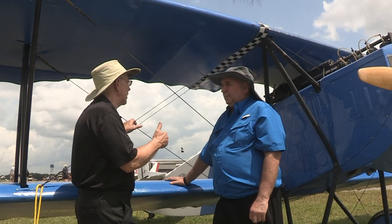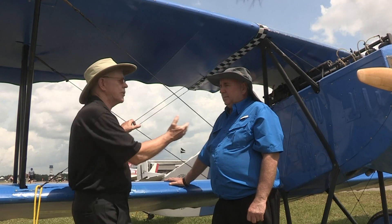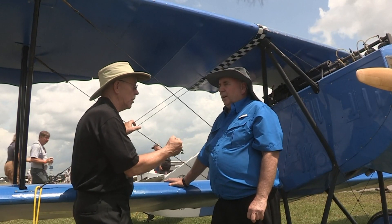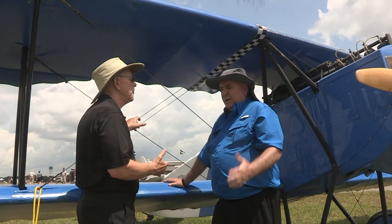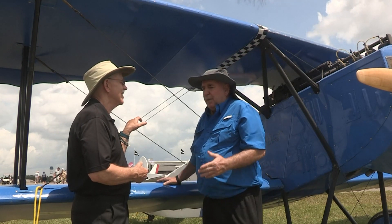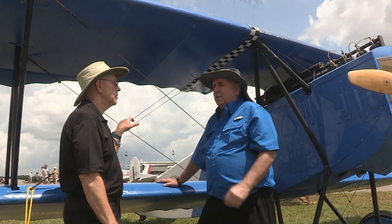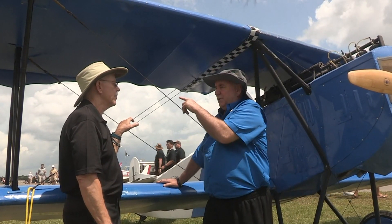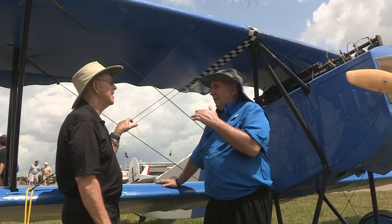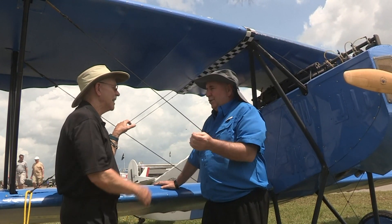Let's talk about how it actually flies. What's it like in the air? It's a joystick with rudder pedals. This airplane doesn't have brakes, so there's really nothing to do there. Control-wise, it's three to five pounds of control pressure, pretty light on the ailerons because of the boosted ailerons — they've got those elephant ears on them. They figured that out back in the day. Anything on the surface they would hang in front of the hinge line would effectively give power steering, lightening the controls.